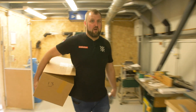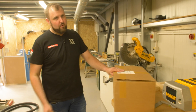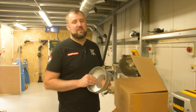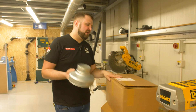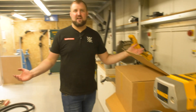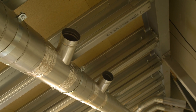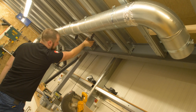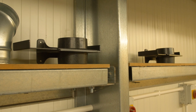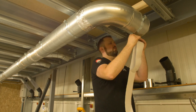All the pieces have finally arrived — it's been about a week and a half since I was last doing this ducting. We've got everything from Axminster, but this was the elusive part: a 200mm down to 100mm reducer which I absolutely needed and couldn't do the job without. This took weeks — Axminster couldn't get it for me so I ended up cancelling and ordering it from a ducting supplier. That slowed down the job, but I've got all the pieces now. All we've got to do is put in these final three legs — cutting some 100mm ducting into about 80mm pieces to connect up the blast gates. Once those are done we can power up the system because we can close all the gates and have a sealed system.